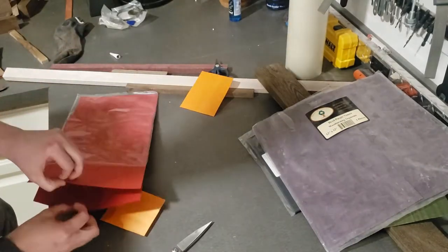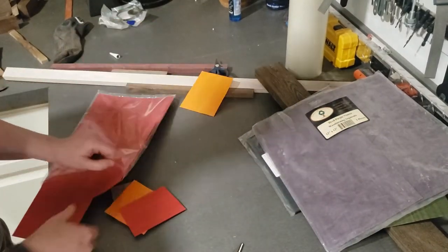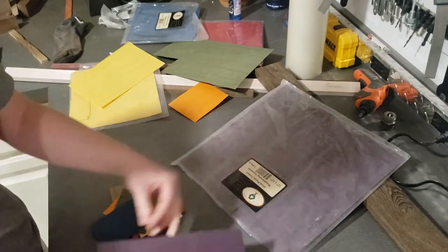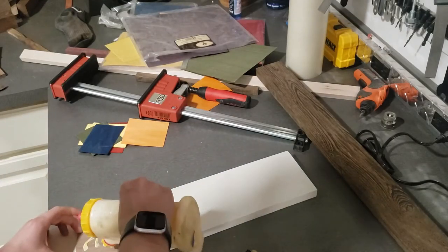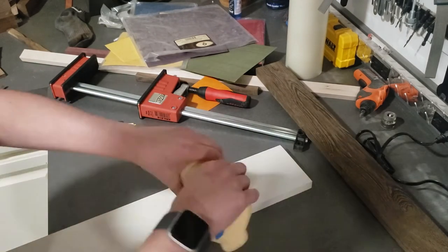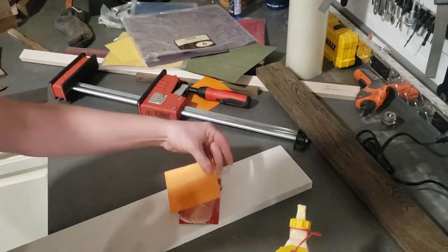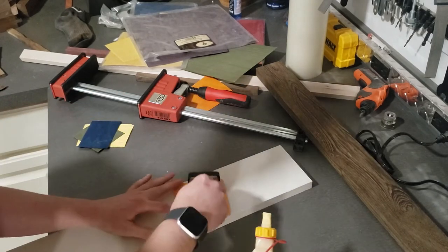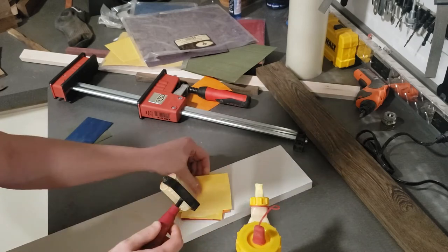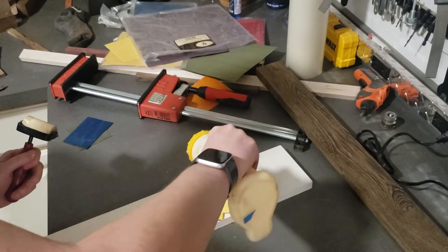Some of these fish hooks are going to have a rainbow inlay in them, so I'm just getting pieces of veneer cut down to size and I'm going to laminate them together like plywood. I'm going to be alternating the grain pattern, and that's going to allow for a lot of strength because when the grain's running the long direction it's really difficult for it to snap. By laminating them together you're able to get a lot of strength in a small space.